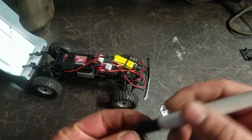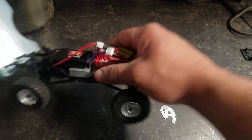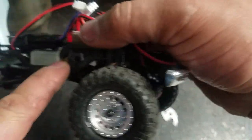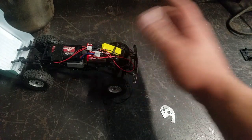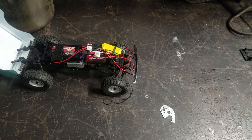This is a hypothetical. I have never seen this. I have over 200 kits in the market now. Nobody's ever reported back that we've had gear slippage, but it's something to be cognizant about. So if you put a mark on the brass gear and the motor shaft, go out and do your thing. Run it through some obstacles, up over things. I had somebody towing a small weight pulling sled with it.